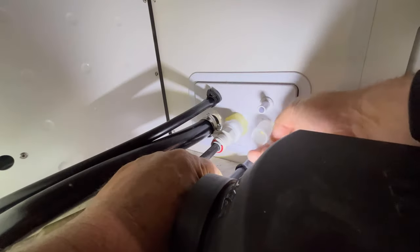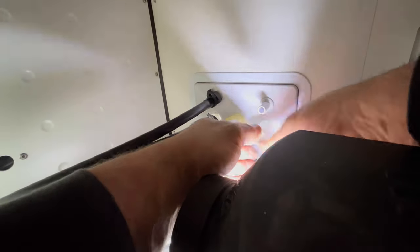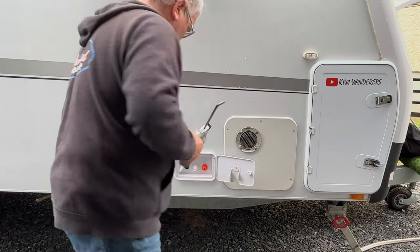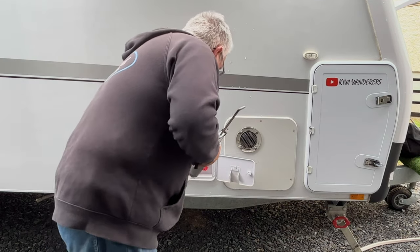There's a simple hose clip — remove the hoses. The fittings turn about an eighth of a turn counterclockwise and then pop out very easily. Fitting the new fitting is just the reverse of that. I put a small smear of silicone on them to make sure they don't leak, then reassembled and we are good to go. I also purchased a couple of irrigation caps from Mitre 10 to seal these off.